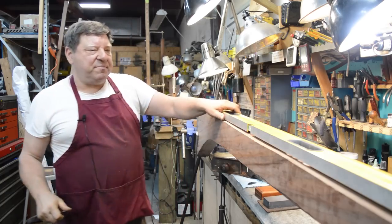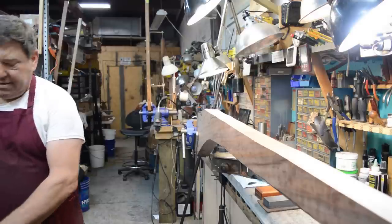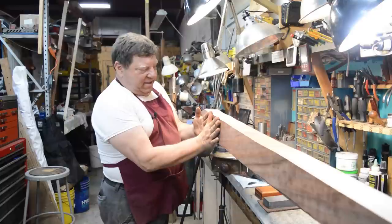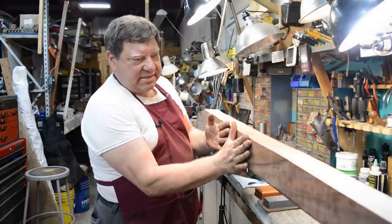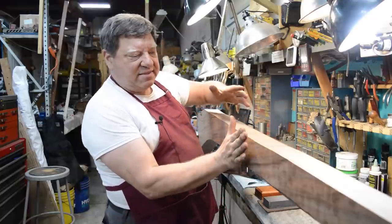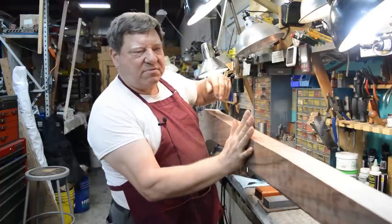So step one is, we've got to turn this piece of lumber around, because I'm right-handed, and this wood grain is like the fur of a cat. It's running uphill like this, and you don't want to bring a plane in this way. I'm right-handed. This wants to be cut this way. It does not want to be cut this way.